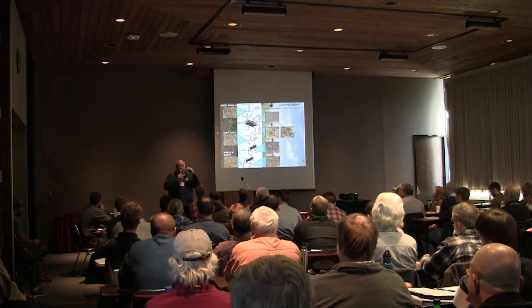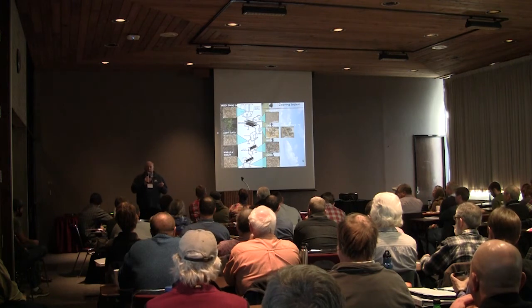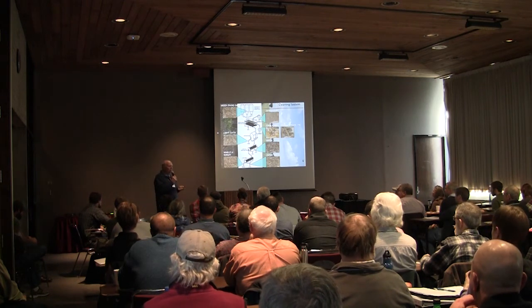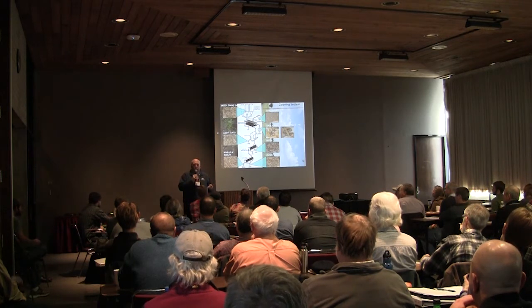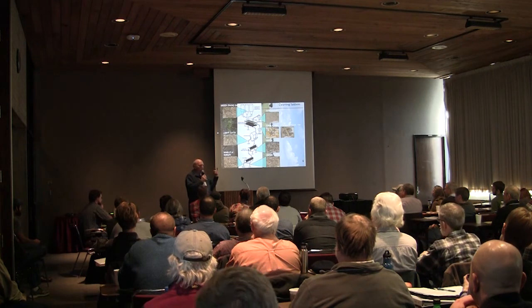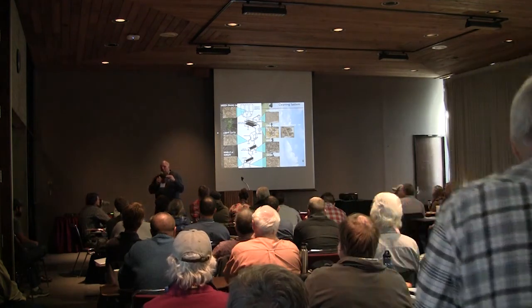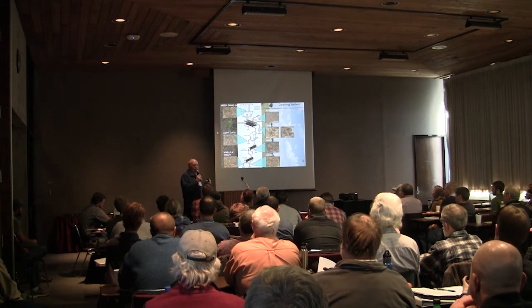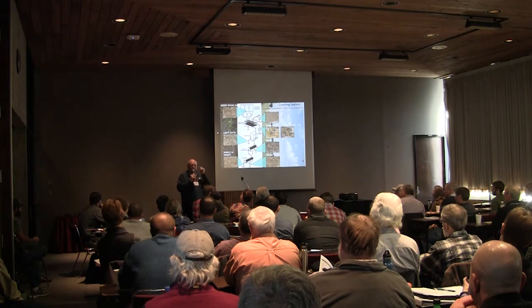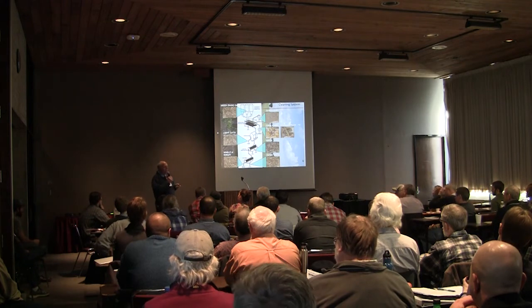Well, if you have a barley kernel that gets into that oat mill, and it's by default the same size as an oat groat, and you go through the steamer and the flaker, you wind up with a little barley in there, which, number one, yes, is bad for the gluten-free status. Number two, you wind up with little pieces of hull. And if you ever have consumer complaints on sticks or something sharp in your oatmeal, chances are it's not a stick, it's not a piece of straw, it's a little sliver of that barley hull. That's one of the biggest consumer complaints that Quaker had for years and years.